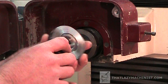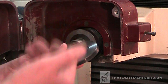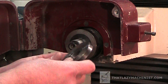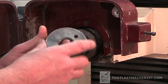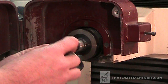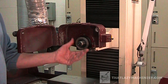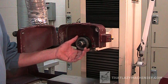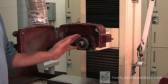I'm going to want to keep an eye out for damage. Since I've just removed this threaded flange, we're going to take a few seconds to visually inspect it and see if everything's okay. Looking at it, everything seems fine, so we can just set this aside and move on to our next operation. However, this second flange — the one that was mounted directly onto the spindle with a taper — it's going to have to be inspected a little more closely.